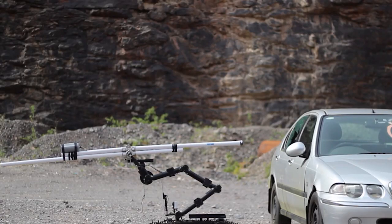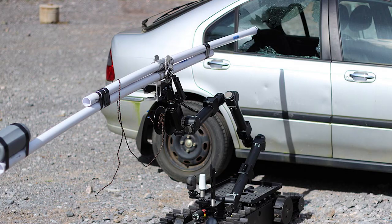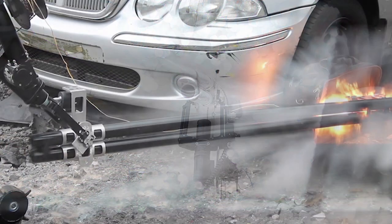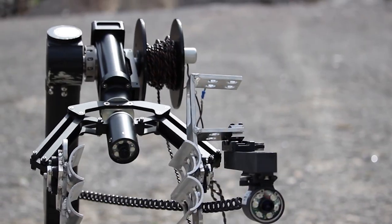You need to deploy multiple Alford systems with a single robot approach, and this can be achieved with a range of simple tools. The twin pole will allow the deployment of a window breaker and water bottle charge in one approach. The twin pole design maximizes rigidity during deployment using low-cost, easily replaceable household plastic pipe. The twin pole can even be left on target with the mineral water bottle, and the robot retracted to a safe distance.